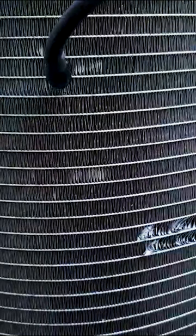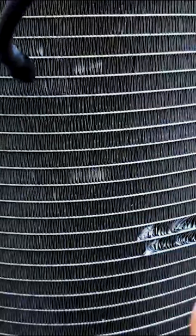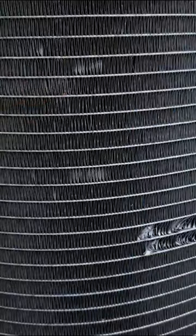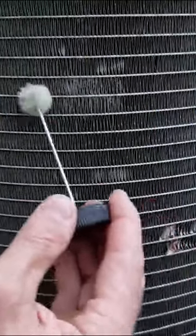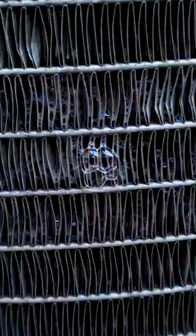You can also use it on micro-channel coils, so on outdoor air conditioning systems you can just pan back and forth until you find the leak — you just hear the escaping gas with this tool. Once you find the leak spot, you can add bubble leak detector on and see the exact location where the escaping refrigerant is leaking.